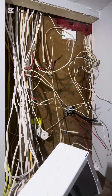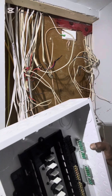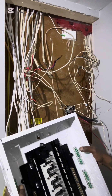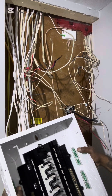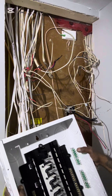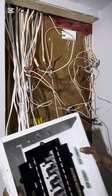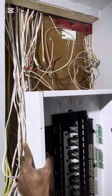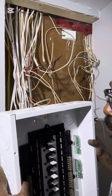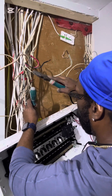I have to flip my panel the other direction instead of being the normal way. This is allowed because there's a code rule that states that your breaker has to be at a certain height. This is within that certain height, so I can take this panel and flip it the other way, and that's exactly what I'm going to do to make this work.